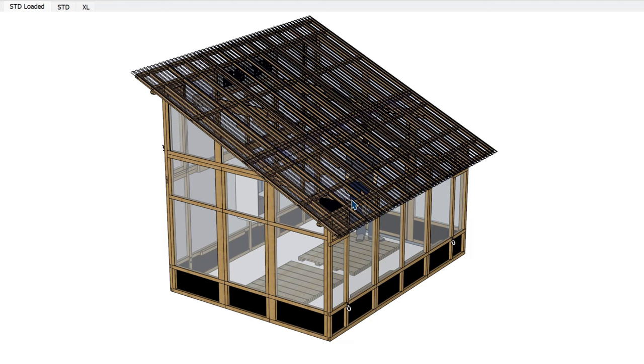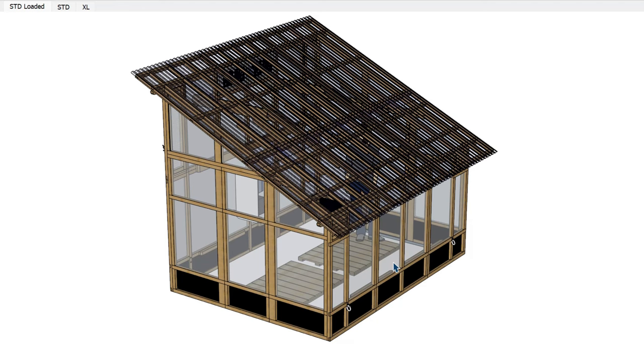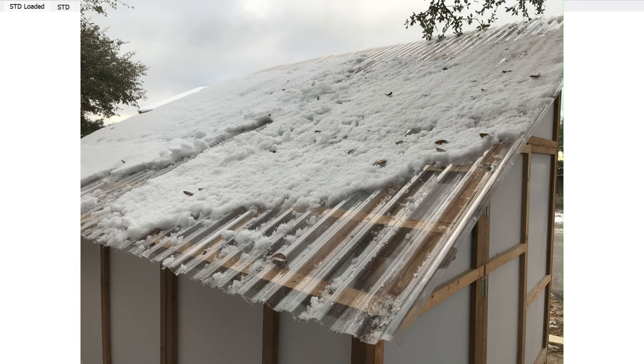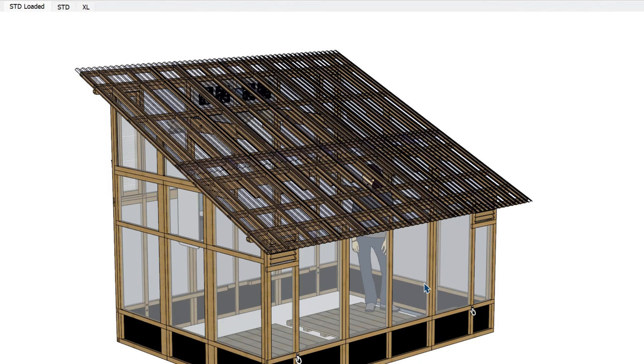In a lot of ways, this entire greenhouse is designed around the roof. It was a really important part of the whole design consideration. If you do even a cursory reading about greenhouse design, one of the things you'll notice is that a big problem with greenhouses is snow load. We actually tested snow load by putting a ton of sand on top of the roof. But rather than designing something engineered for snow load — which is complicated because snow, depending on how wet it is, creates a really big difference in load — we just designed something that would tend to shed the snow. All but the very stickiest snow will shed at anything over 25 degrees of a slant. So we have a pretty radical slant on this greenhouse, and that's kind of how it got its name: the slant roof greenhouse.